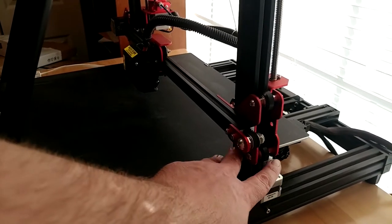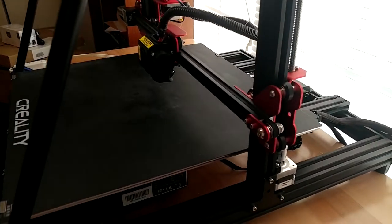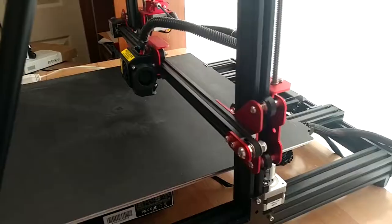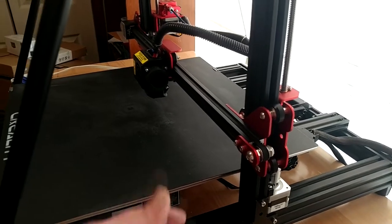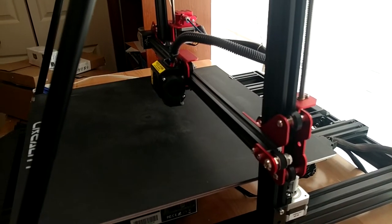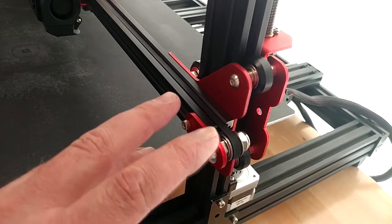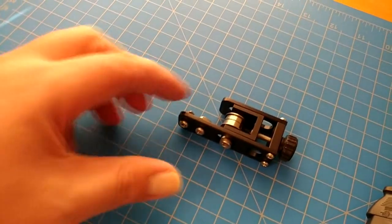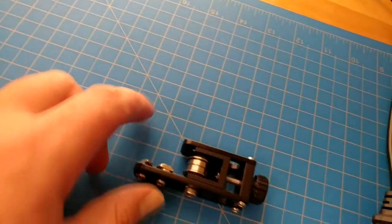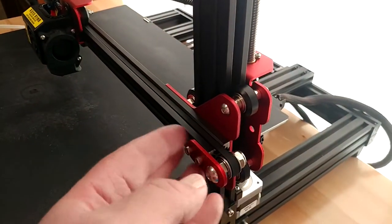So what I think is going on is that these two things are not responding the same way from side to side — it could be that they're set wrong or something's too tight or too loose, and it's crushing parts as it's printing them. So what I'm going to do is tear this entire Z-Rod setup and the x-axis off, go over it nut and bolt, see if anything's out of place or has a bad bearing. This came this way out of the box from Creality — Chinese 3D printer company, you just kind of get what you get. And while I'm at it, I'm going to replace this end with a manual tensioner for the x-axis belt. This kit comes unassembled from Amazon — I'll throw a link in the description. I think it was like $15.